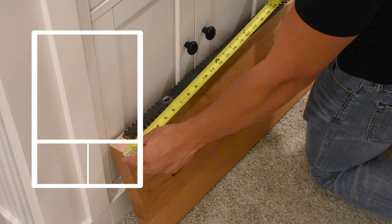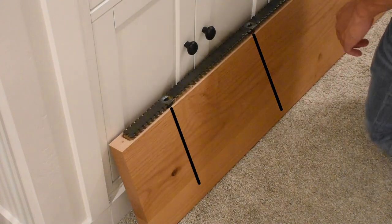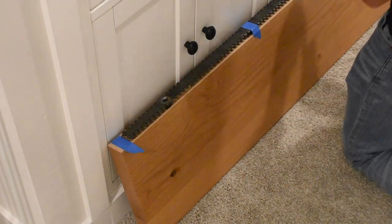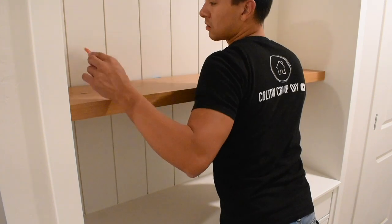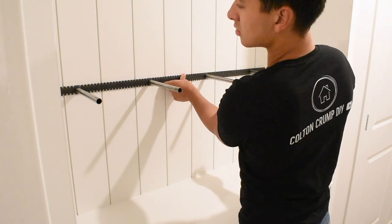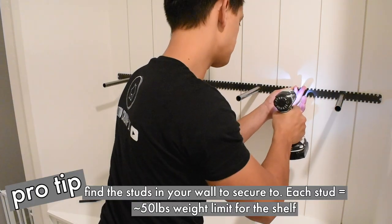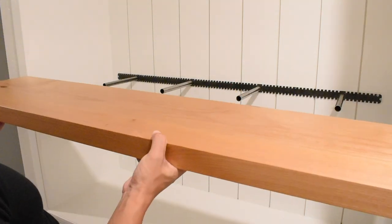Because these floating shelves are going into a built-in area, the hardware placement needs to be very precise — the rods have a specific location and the sides of the shelf would hit the wall if I go too far left or right. So I took some painter's tape, secured the hardware to the shelf so it wouldn't move, then put tape on the edges to indicate the boundary for hardware placement on the wall. I held the shelf up, marked where the hardware could not pass on both sides. With those marks and the shelf-spacing marks, I took the hardware, grabbed a level, screwed in one side, leveled it, screwed in the other, and added the rest of the screws. For maximum strength, make sure you're screwing into wall studs — the number of holes in the hardware makes that easy. Grab your shelf, line it up, and slide it on.